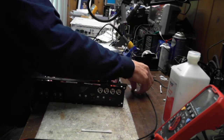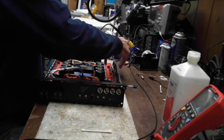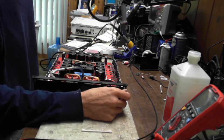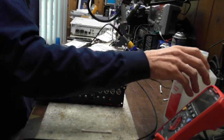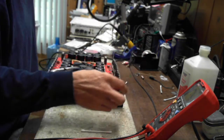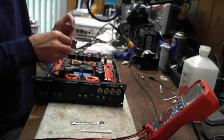All right. Here's another tip of the day, guys. When you are working on these amps that have those dreaded clips that hold these against the heatsink, always make sure you put the transistors in at the right height. I got a little too relaxed with what I was doing on an amp, and I set the transistors too high. So it ended up the transistors were shorting out against the clip. Of course, the clip is grounded to the case of the amp. So, ugh, what a nightmare.